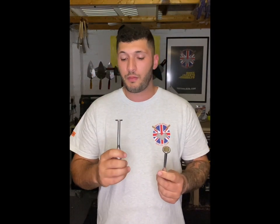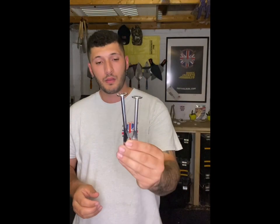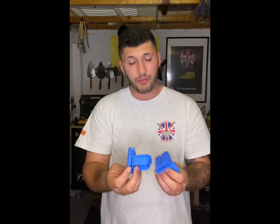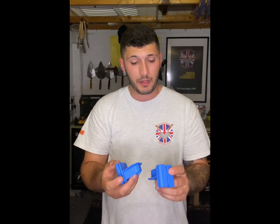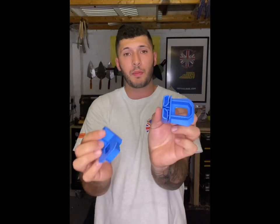A set of Footprint pins — you know it's a Footprint pin because it's got a foot on it. I've been to car boot sales and picked up pairs of these for a pound each. They will last you a lifetime if you look after them. For your line you'll also want corner blocks. These Footprint corner blocks are probably the best on the market at the moment, with a little window for when you're using profiles so you can see your gauge mark and string line.